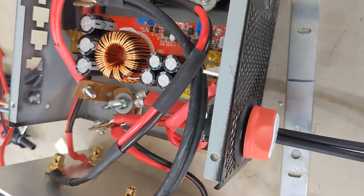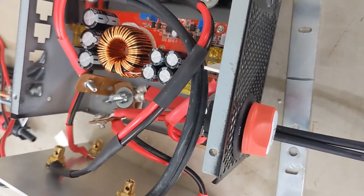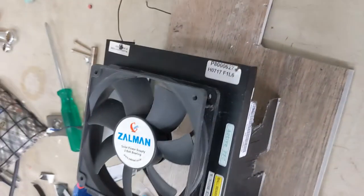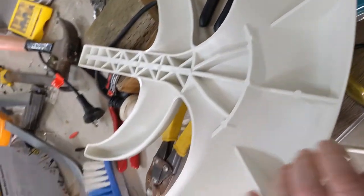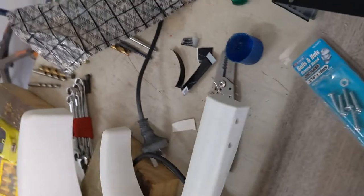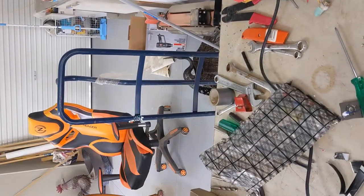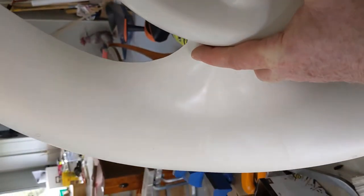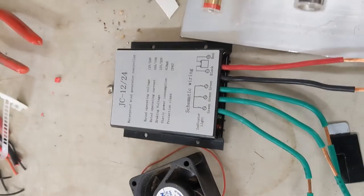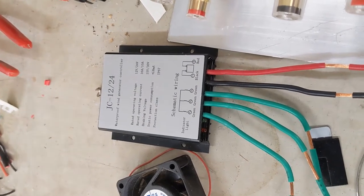The wind would just provide essentially a trickle — we're putting 200 watts in if it's going at full belt, which I doubt. Now, these are the turbine blades. You can see they're a cup design — they've experimentally changed the shape to try to minimise drag. But the problem with cup design is that when going away from the wind it catches the wind on one side but drags on the other. These have an upper limit, which is again why they've got a 200 watt charge controller but a 1.2 kilowatt generator.